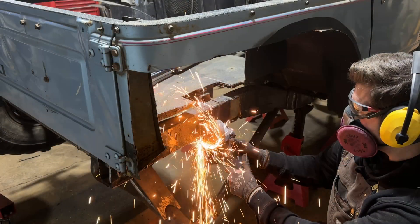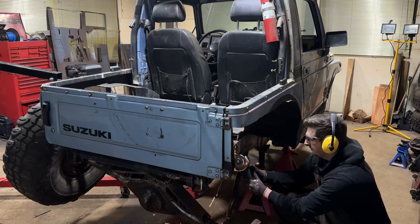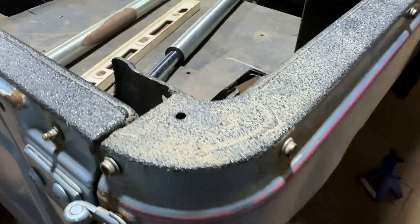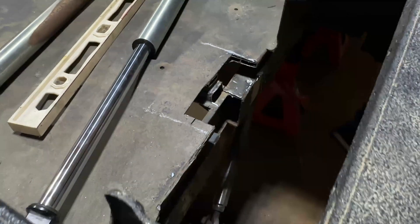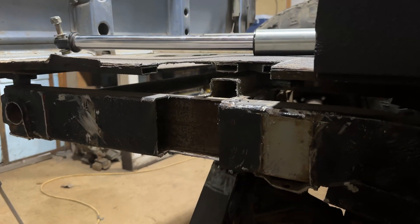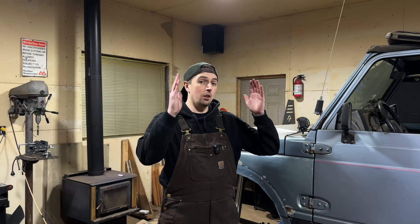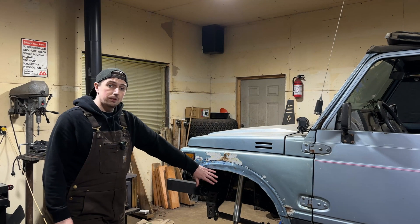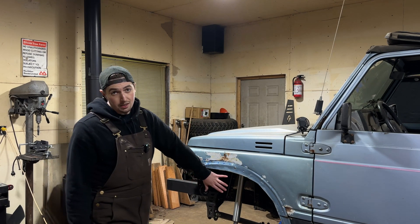Essentially what that means is that I'm going to cut away a section of it and I'm going to sink that whole air shock mount into the frame. With that air shock mount sunk into the frame rails, we should stiffen things back up and add a lot more strength. So we're not really going to compromise on strength with this approach, and we'll likely have to tie in the top of the air shocks together because they're going to have a lot of leverage with how tall these air shocks are going to be. We don't want those things swinging around and twisting our frame and slowly starting to fatigue and fail. We're going to run with the same style of design of air shock mount that we have on the front of the Samurai and start getting this thing to actually fit and articulate properly.